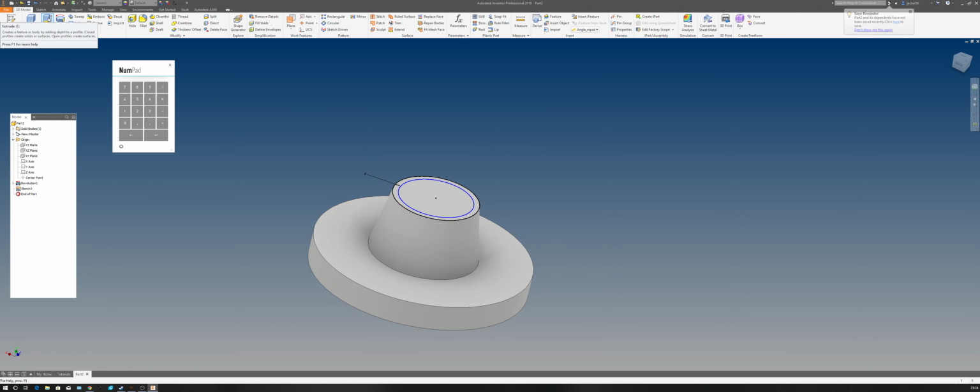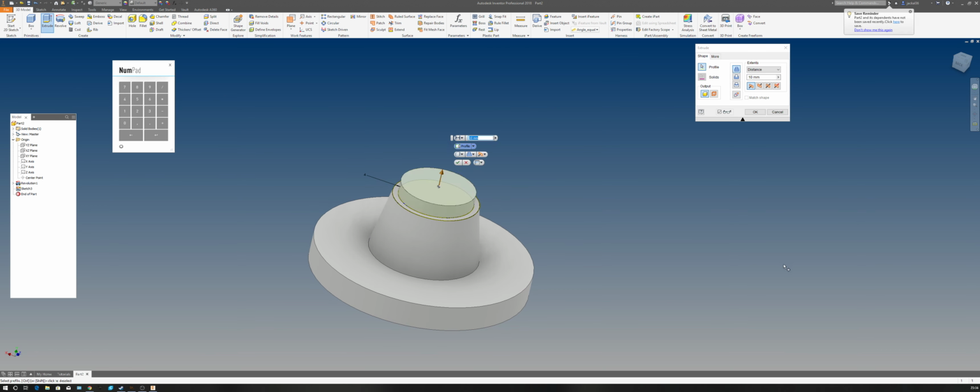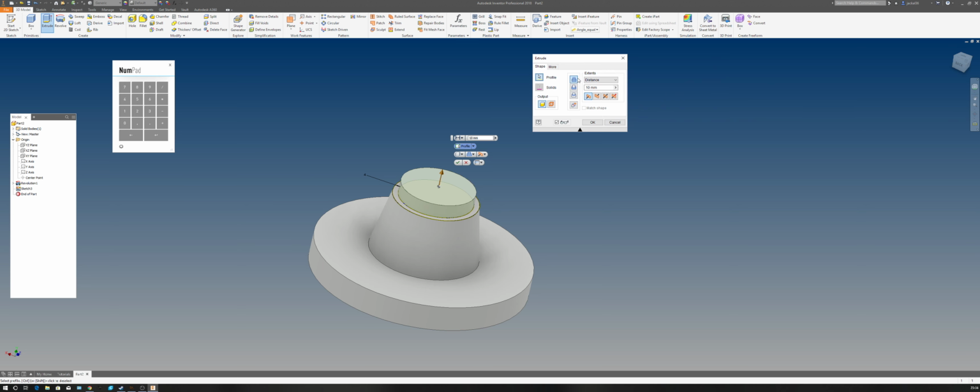We then go to extrude. Select that circle. You see there's an arrow going up there. That's to add material, that's to take material. And there's your distance. So that from there, that surface to that top surface here, this green piece, is 10 mil. If I change that, I can change that to 50. See, it changes. To change it in the other direction, you can change it that way, but you'll notice that goes down to cut, which means taking material away.